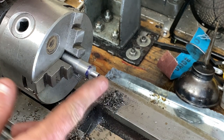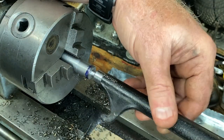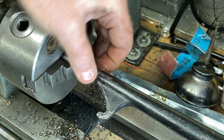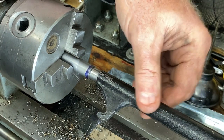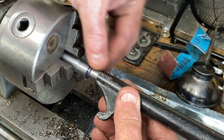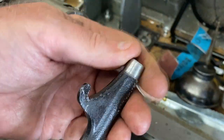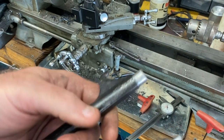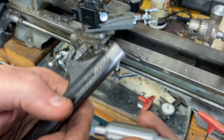About 0.140 to go. Getting close — we'll bring the last bit in with a file. When you're doing this by hand with a file, you put a chamfer on it, keep a mental note of how big it was, start filing it down, and that chamfer starts to disappear — then you've got a kind of a gauge measurement in your brain. Perfect — I just want it to slip in and give us some rigidity. It's at 1.260, so it's 0.010 over — that's fine. I did taper the small end to big end using the compound. It slips in — and remember this is that diameter, and this down here is pretty close to that.